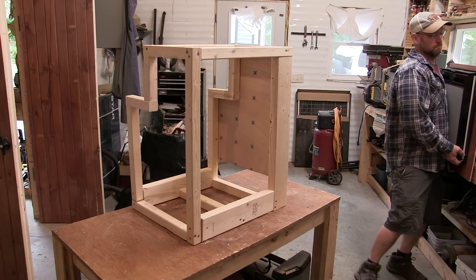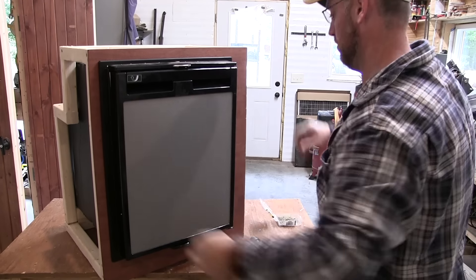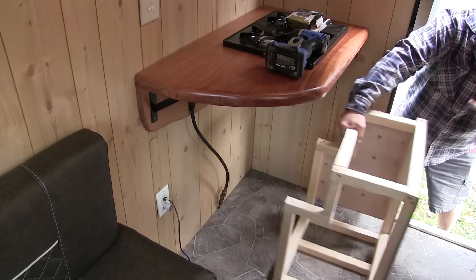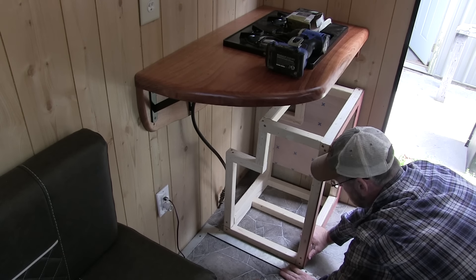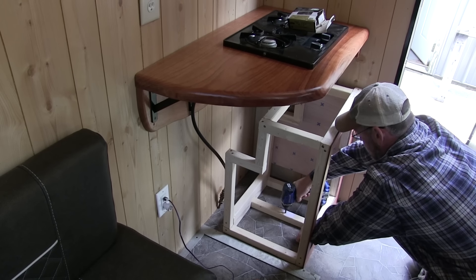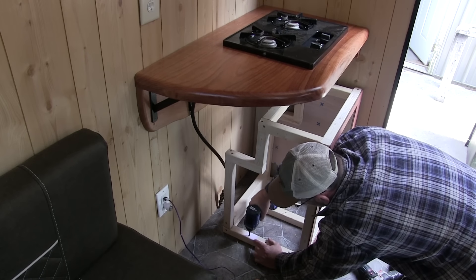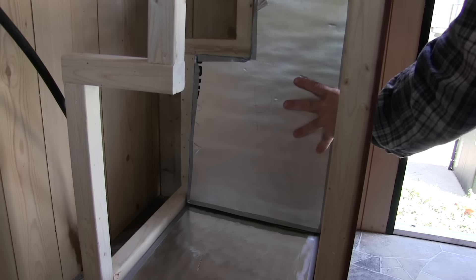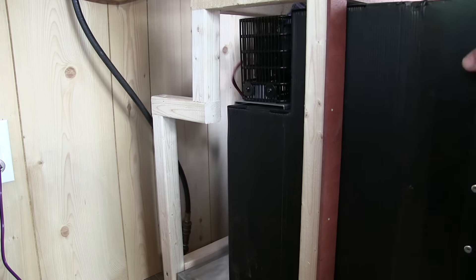That should work. I'm going to nail this up with the fridge in it, that way I get it in the right place. The refrigerator requires a few inches of clearance behind it for airflow for the motor, so I kept some space behind it, and I used a square against the front wall to make sure it wasn't all out of whack. I think this insulation will not only help keep the fridge cooler longer, but I also think it will fill that void so the hot air from the motor won't get trapped inside the frame around the refrigerator.